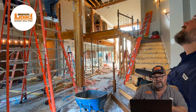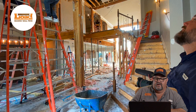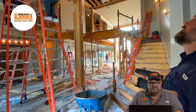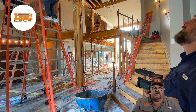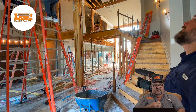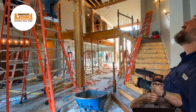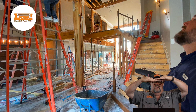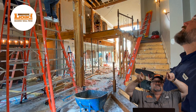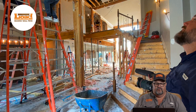Now this is all opened up up here. You can see that was once a room and now it is open to below — I think they're going to do a handrail or something there. They probably had a pretty inventive architect to come up with this plan. The reason this column is so beefy is it has a lot of weight riding on it — it's got the second floor. So that column is coming down in the center. Right now the weight is sitting on the walls and bearing in the center, and we've got to span all the way across so the exterior walls take the load off of that column in the center of the room.